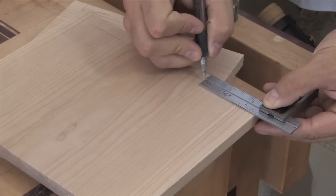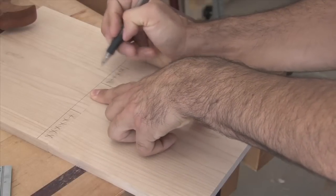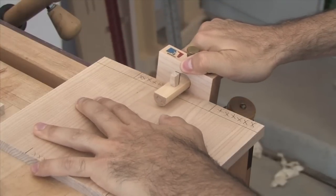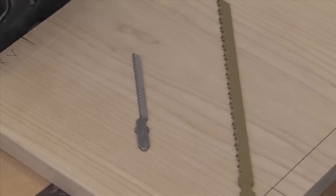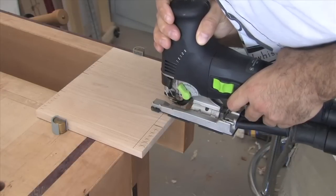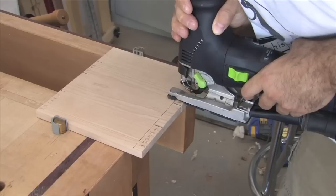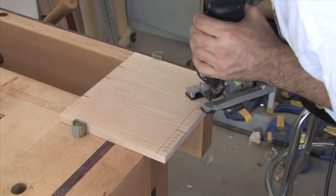Using the diagram and plan as reference, I lay out the joinery on one of the larger side pieces. Instead of laying it out again on the second piece, I simply transfer the marks directly by butting them up against each other. Because of the risk of cross-grain tear out, I'm using the marking gauge to score my reference line — this will also help later when it's time to do the chiseling. We're going to cut out the waste with a jigsaw. Get a blade that has really fine teeth; a coarser blade would be too aggressive. Slowly make each cut, keeping your blade in the waste area and don't go all the way to the back line. To get the material out from between the fingers, make several relief cuts and then a couple cuts across the grain to clean the bulk out.